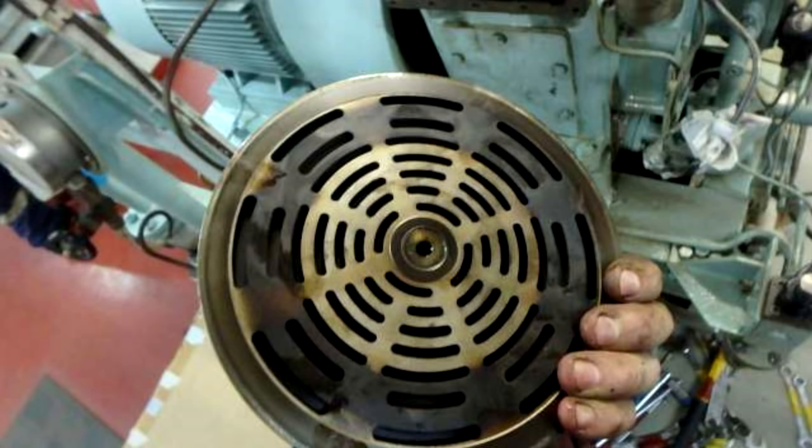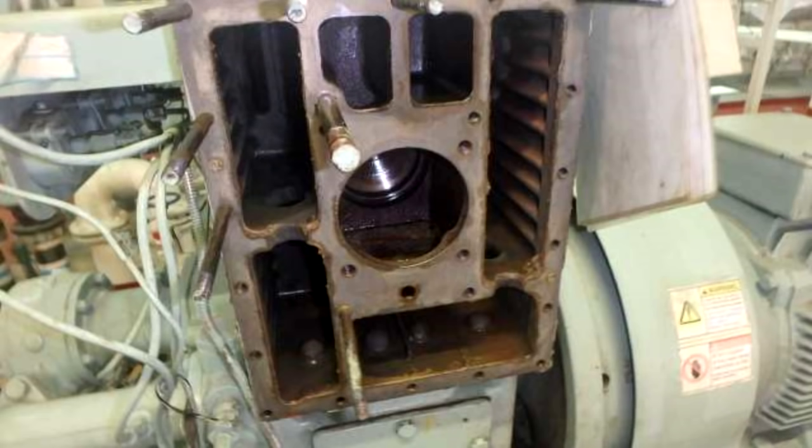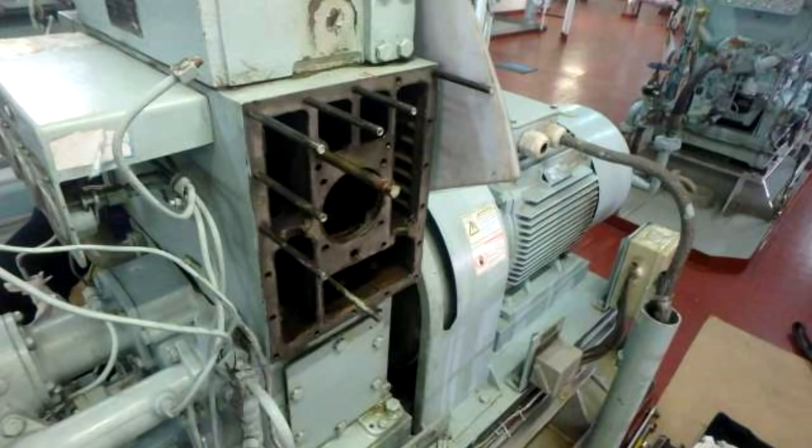The valves must be inspected and overhauled, and also checked for any leakages to determine if the valve is broken or not. As you can see, I have also removed the side covers, the suction valves, and the delivery valves, which is in the middle in this hole, was already removed. And also the cooler of the air compressor has been removed, so we will clean inside.